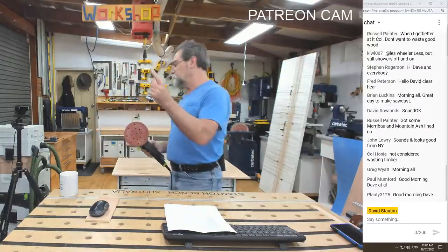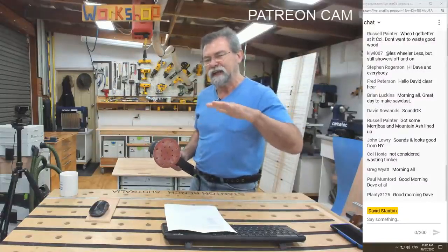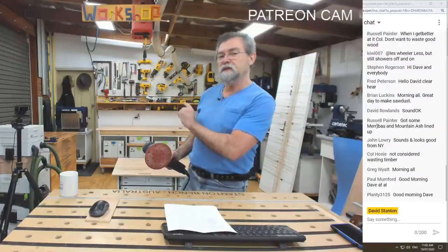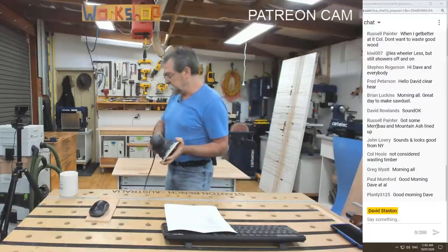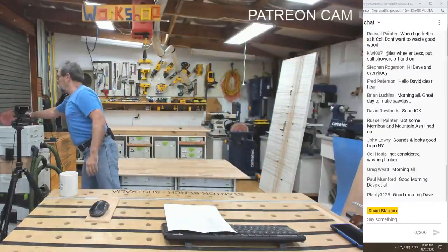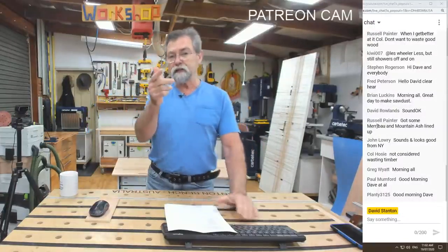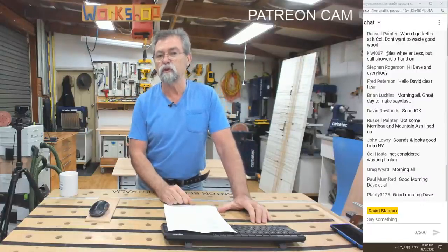It's going to be good because on the back of this particular top, I need to just clean it up a little bit before I start sanding it smooth. On the back of this one, I'm only going to take it to 120 grit. On the top, I've taken it to 4,000. Some people have been saying, Dave, it's obvious you don't know what you're doing because if you take it to 4,000 grit, you're going to close all the pores. Correct in the majority of situations, but for Liberon finishing oil, they say to take it to 1,500 minimum.